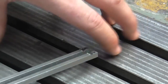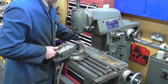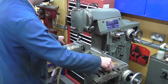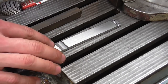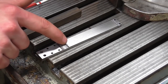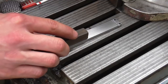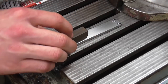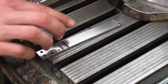I'm now finished with working on the table so I'm going to put the vice on. I'm just about to load this part in the vice but before I do so I want to get rid of the burrs. Now here's a little tip: when trying to deburr something like this with a stone or a file it can be tricky because you're trying to remove the burr but not dig into what will be a running surface. When you try and use anything on this the tendency is for the front end to dig into the surface, and equally if you try and avoid that by leaning backwards you tend to round the back end off.